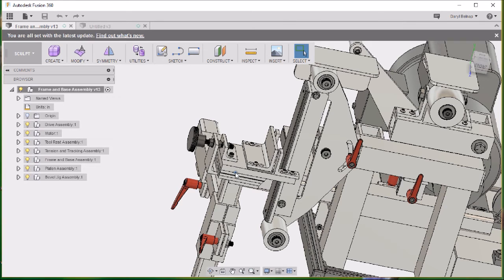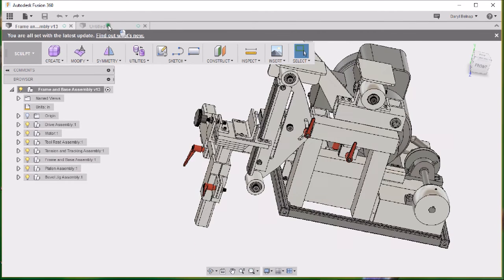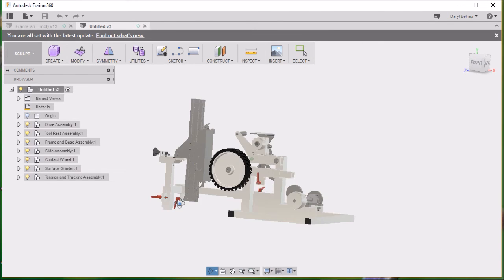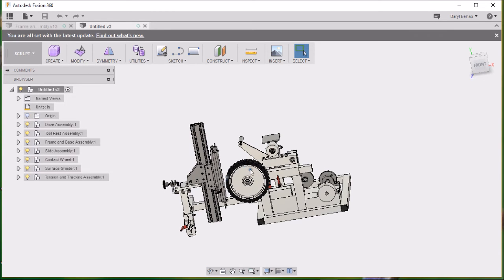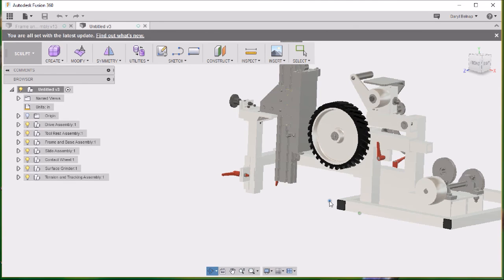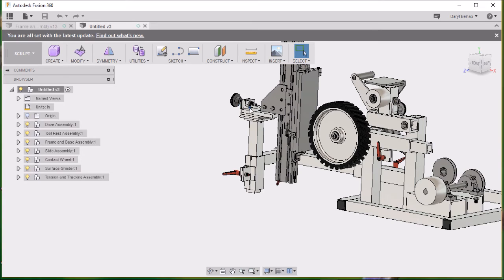In addition to that, I am working on this idea here. This is the machine with the hollow grind contact wheel on it. There's a 10-inch wheel that I use to do hollow grinding. It goes in place of the platen. You just pull it out and plug it in. It's very quick. But this thing is going to be a surface grinding attachment. You can see here that it will transit in and out. I just put the bevel jig in there for now, but it'll be similar to the bevel jig that will push it in and out to the wheel.